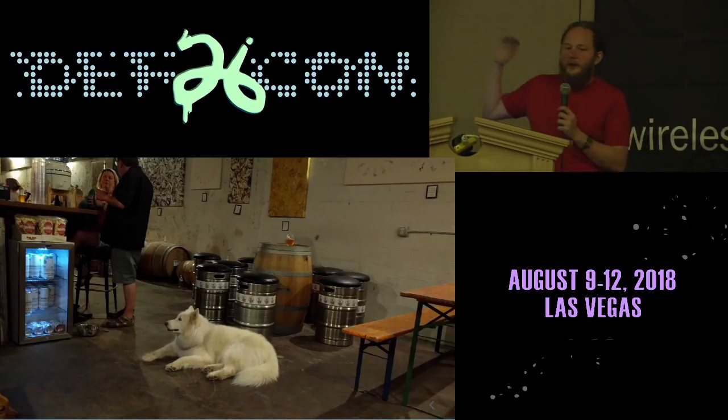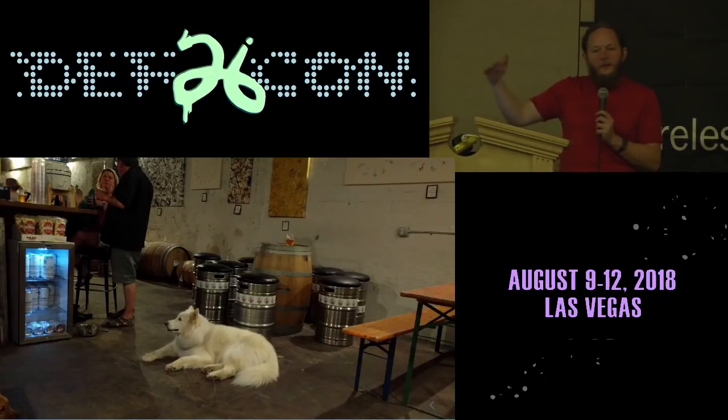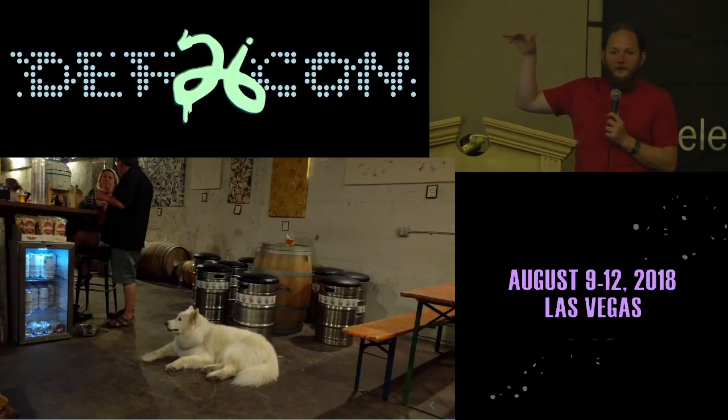For now, you should just be running everything from the Git master. The software is backward compatible with every hardware release, so we've not broken hardware compatibility at all yet. The new boards that arrive Monday add better ground plane stitching, so the battery ought to work even as it gets lower, and the life will increase. And then the revision after that adds the wider radio bands, and that requires a different set of components.